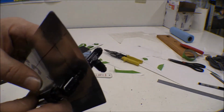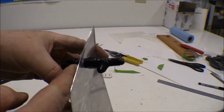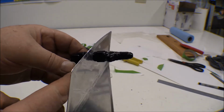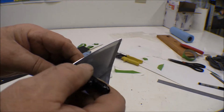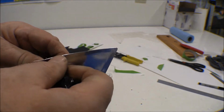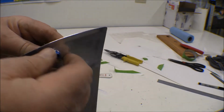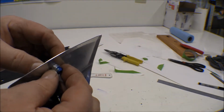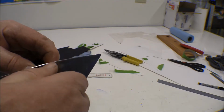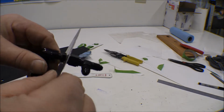And this side, see the fitting, we've got a fitting that goes from 1/8 inch pipe thread, which comes out of this elbow here, and then an AN flare fitting, and that's what this T fits on there. That goes through that hole. Well, I put a couple of O-rings on either side of that that can be compressed down and still make a tight fitting on that flare fitting. That'll tighten that up pretty nice.